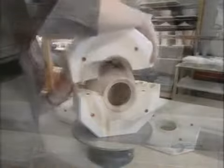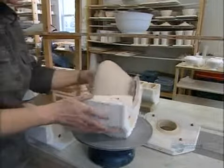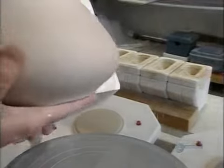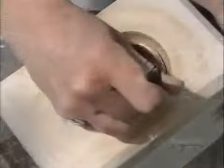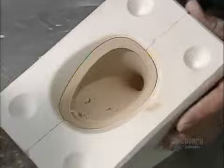After pouring the rest out, she waits another 30 minutes for the crust to continue hardening. Then she peels away the mold and gets a first look at her teapot. Here, she removes excess crust from a different mold for the spout. She waits about 10 minutes until the spout is hard enough to handle, but still soft enough to sculpt.